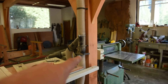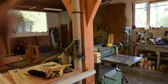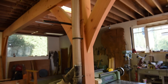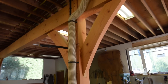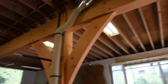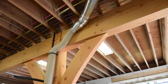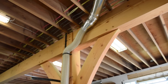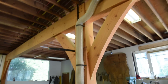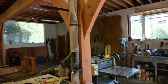Other than connecting directly from your valve to your tool, all the rest of this should be either PVC pipe or metal ducting pipes. You can see I transitioned a six-inch pipe right there. I'm going to take the rest of this off and replace it with four-inch metal ducting pipe and just tape up all the joints in the elbows. That should definitely help my airflow.